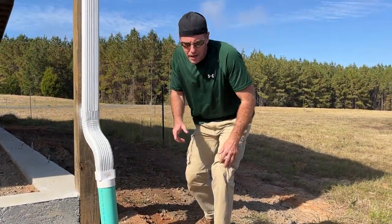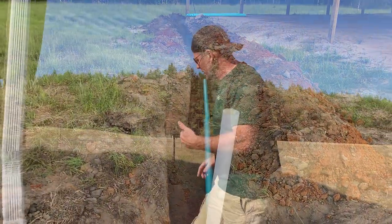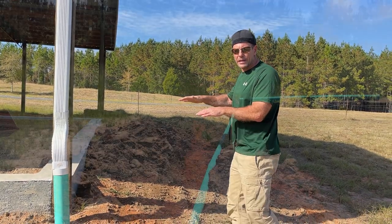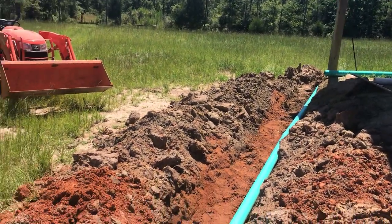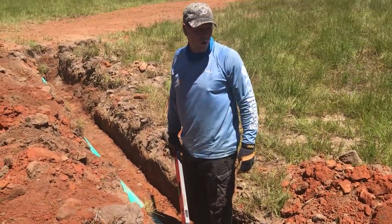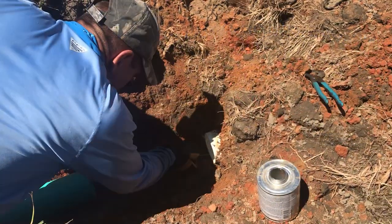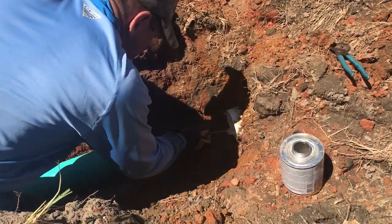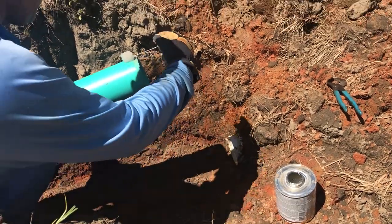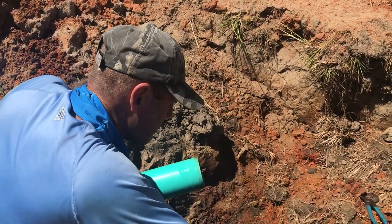On the last day of putting in that six-inch pipe, I went ahead and dug this 60-foot trench. You can see that the pole barn is elevated about four feet above standard grade. I sloped this pipe through that extra dirt and then connected it to a Y-fitting that I'd already pre-placed on the six-inch pipe. So the six-inch pipe adapts down to a four-inch pipe at the Y.